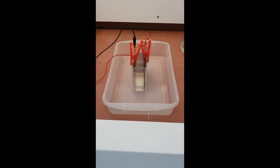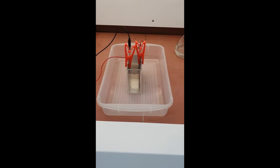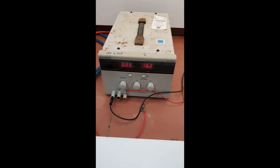Also, as safety is always a top priority in the lab, we don't forget to have a bund underneath the experiment. Now we just do a simple calculation to find the total exposed surface area. Our chosen current density is 500 amps per square meter, which gives us a target amperage of 4.49.